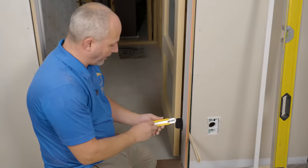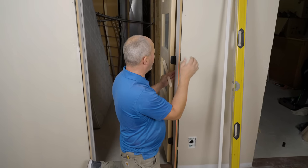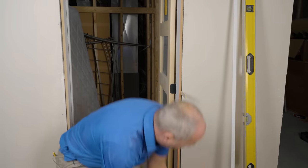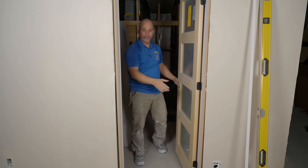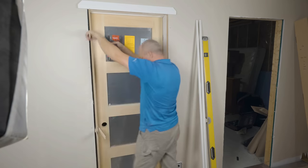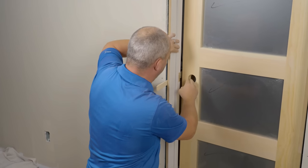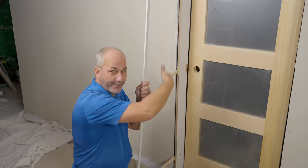Now I'm on my one eighth. There are two ways to cut off extra shims — you can score and snap it, or if you have a whole bunch, you can use a multi-tool. Now all we have to do is do the same to this side, but we want to use the door that's hanging off the hinges to set the depth — this is the best system. We've got a pretty consistent gap here. The biggest issue is when this material is on and the door is closed, is there a gap? Because this is a privacy issue. As long as there's no gap, then we're fine. Try to keep this edge as straight as possible so your next material will go on looking good.